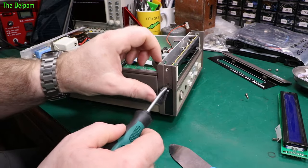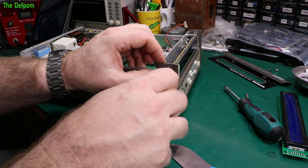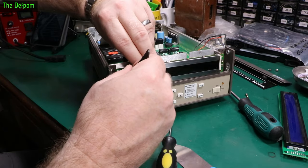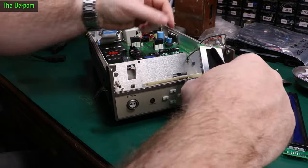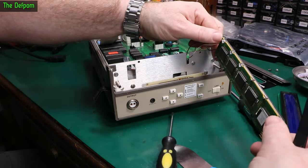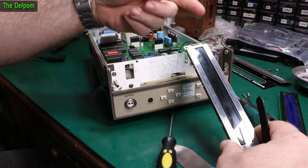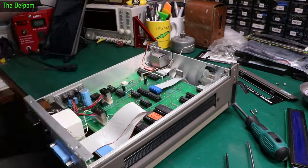Using my spudger to get down to the side so I can get to this little screw here, get that little bracket off. Just loosen this off here. Bolt out. There's the display with the wires for the backlight driver. I'm going to desolder this and leave these wires all tucked up inside to keep it original. You never know if I'm going to replace or repair this display. I'm going to desolder this and just keep that part original. Maybe I'll try and fix this one day — I do quite like the colour because it's orange. It's actually quite a nice colour.